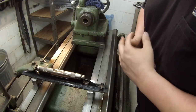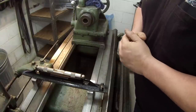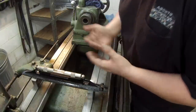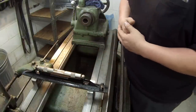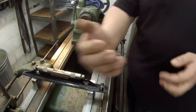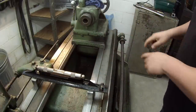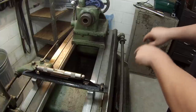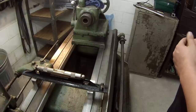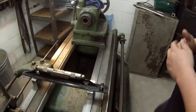I went and got my Starrett 18-inch precision level, set it back up on our 1-2-3 blocks, made sure everything was clean, and the level is still showing near perfect by sight. The outer end was 1 thousandths larger, so what I'm going to attempt is to just slightly move the two jacking bolts on the tail stock side, and then we'll make another test cut to see if we helped or hurt ourselves.